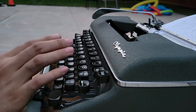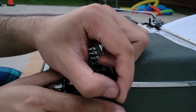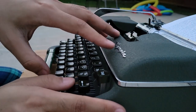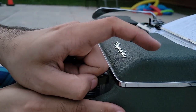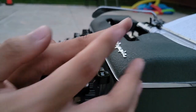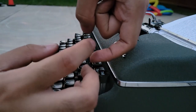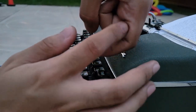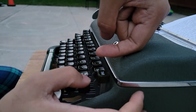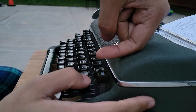Right, I think I forgot to mention the back. I was talking about the Torpedo and how, for me, that is by definition what I call snappy, which is to say, midway during the strike, your force curve isn't one that increases and plateaus, or not linear like a spring, not constant, or not exponential or polynomial, like I would describe the feel of the Smith-Corona 88 secretarial to be, though that machine is still quite fast.